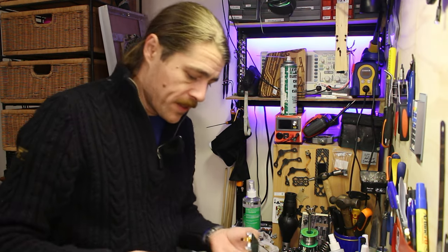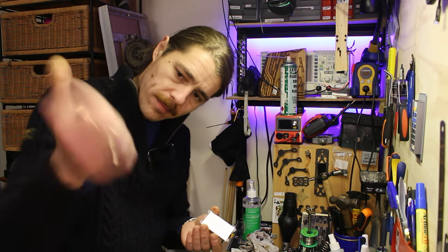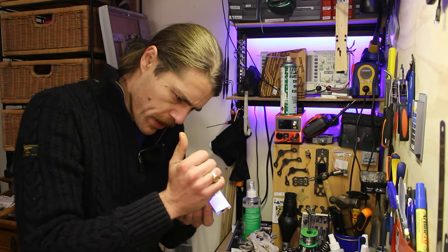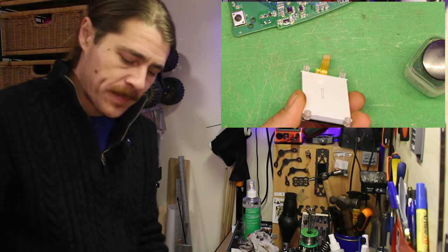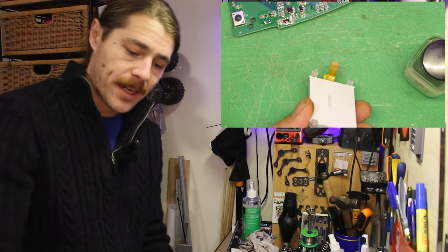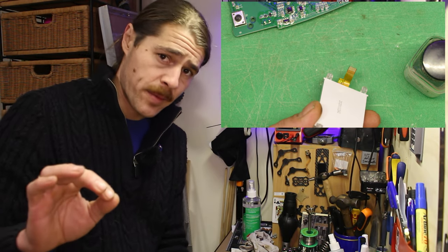One tip while you're putting these things together is just double check. Oh my God, really? I just had you working. Double check you've got no conformal coating on the back of these strips. As you can see, there's no fluorescing there. If you do, you want to get some isopropyl alcohol or some of the circuit board cleaner and a toothbrush and scrub like you are brushing the teeth of a baby bird.